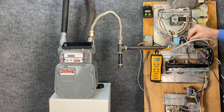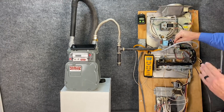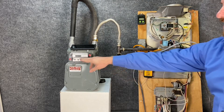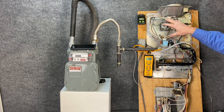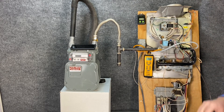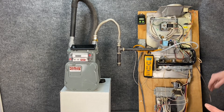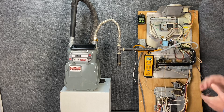What I really want to do when adjusting gas pressure is use a combustion analyzer in the flue gas to accurately set this. But most manufacturers will say 3.5 inches of water column, depending on your altitude — altitude plays a big part in that. Always follow the manufacturer's guidelines and installation instructions; they always override what I say or what anyone else says, because engineers do things differently for different manufacturers.